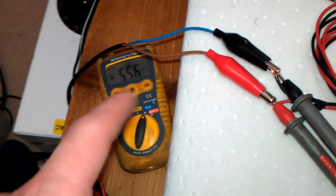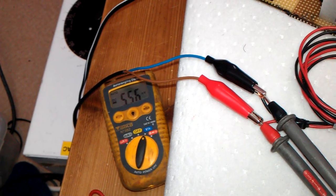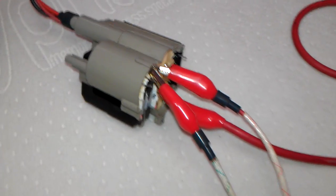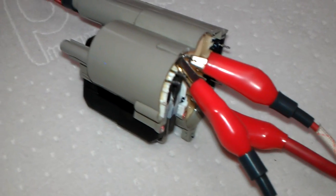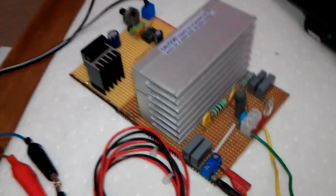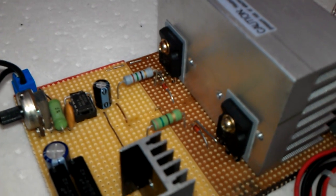There's a little meter there just to show me my voltage input from the variac so I don't go too silly. I'm going to run it through a flyback through the pins now. It's quite a good little driver — there are two IRFP260Ns in there.